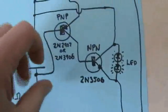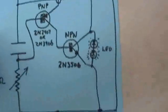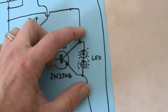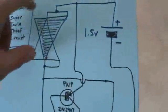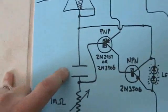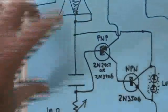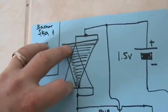You can basically adjust frequency by varying the voltage across here. If you put a scope across here, I can show you this variable frequency thing that the coil picks up. The capacitance I'm using here is 2.7 nanofarads and my coil is roughly 1.35 millihenries.